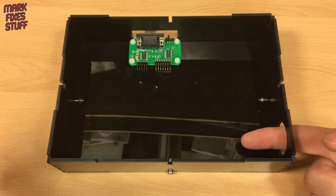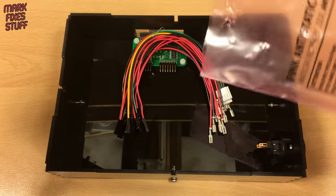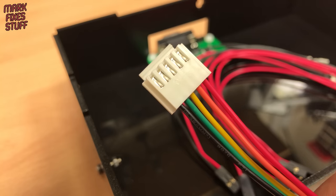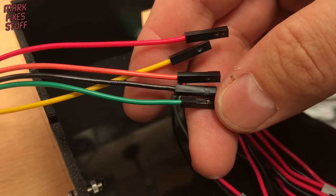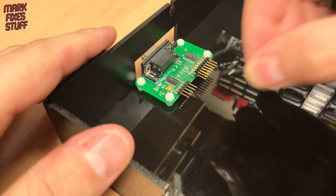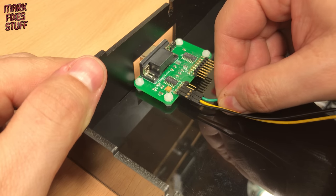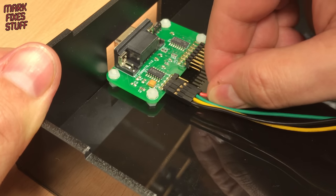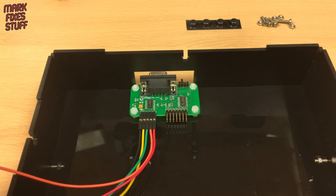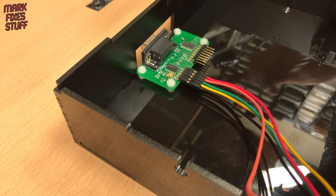We need to use the hole on the side — pop a black button into the side panel. Now it's wiring time. This end fits onto the joystick connector, whilst these ends need to be installed onto the controller board. We'll install them from left to right: first is black for ground, second yellow for right, third green for left, fourth orange for down, and fifth red for up. For the buttons, the pairs of pins are vertical. All the cables are the same red and black, so we can install them in one go.